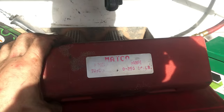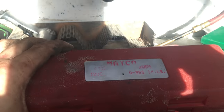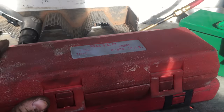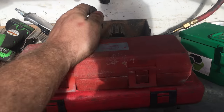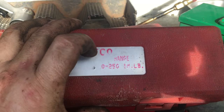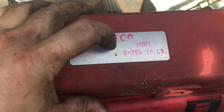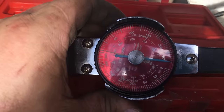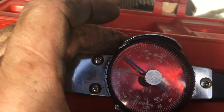In my opinion, this is the best inch-pound torque wrench on the market because it does zero to 250 inch-pounds. On a torque wrench, you want your target torque to fall somewhere in the middle of the wrench's range. For example, if you have something at 100 inch-pounds, this is a great candidate. At 250 inch-pounds you don't really want to use it, and at 10 inch-pounds the graduations aren't fine enough. It's the widest-range inch-pound torque wrench I've ever seen. You've got your needle gauge, you set where you need to go, torque it down, and that orange needle moves.